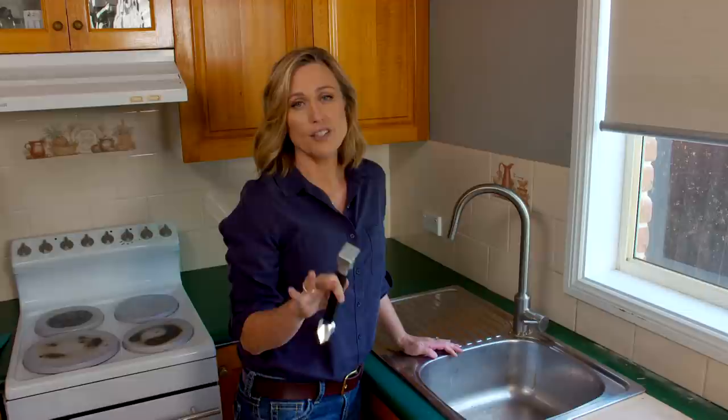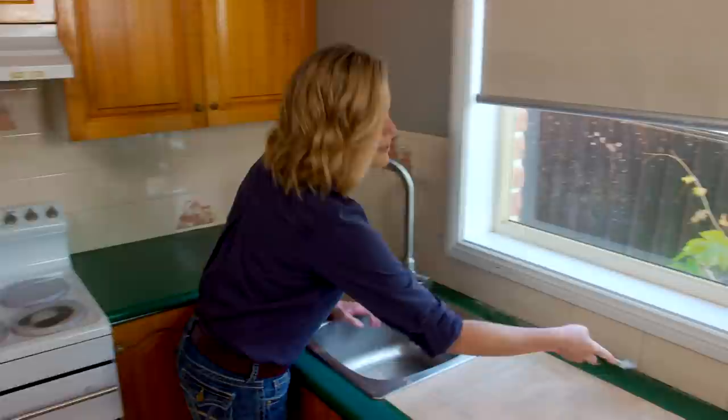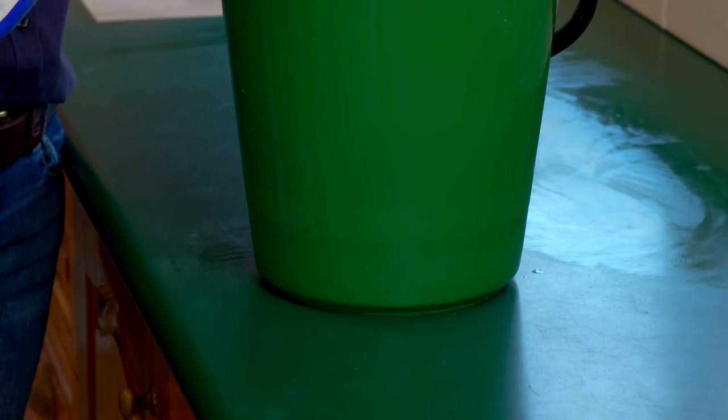If you are painting your kitchen, the most important thing to remember is to prep super well. You need to make sure that everything is thoroughly clean and to take out any gunk between the tiles and also the bench top. A great little tool for this is a scraper. Because I am painting the bench tops, I need to take out the sink — then just take some sugar soap and water and give everything a really good wash down.